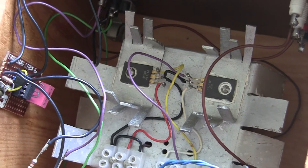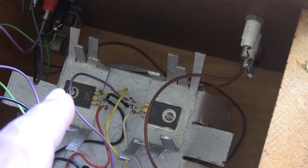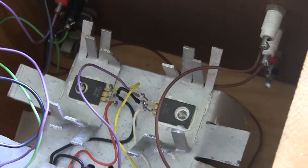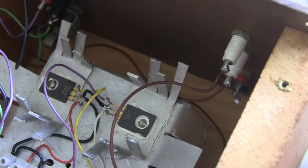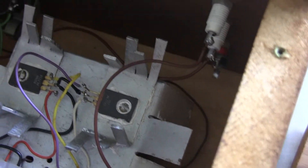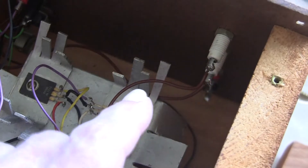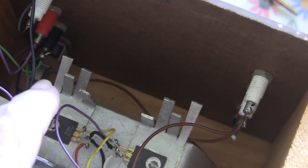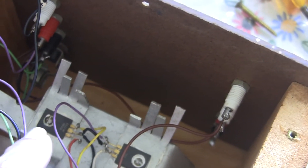This box primarily has low voltage regulation. As you can see I have our popular 7805 and 7812 one-amp three-terminal regulators. Since the box is sealed I don't have airflow in and out, so I have large aluminum fins that I bent — heatsinks of my own — right near where the regulators are. Notice the fins for heat sinking.